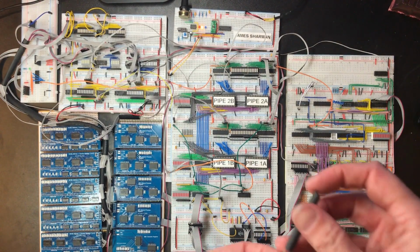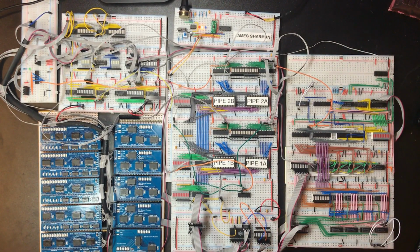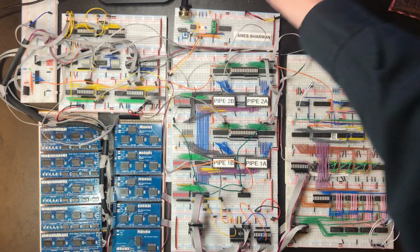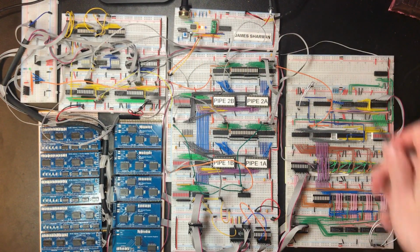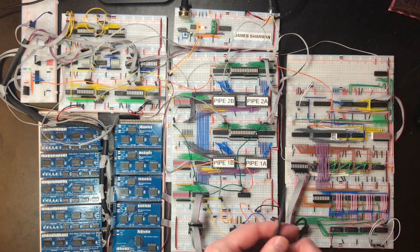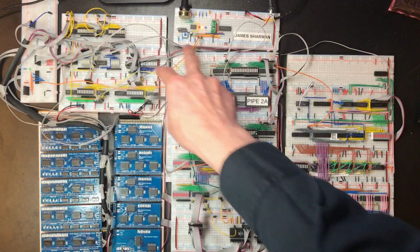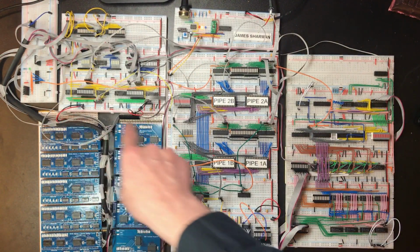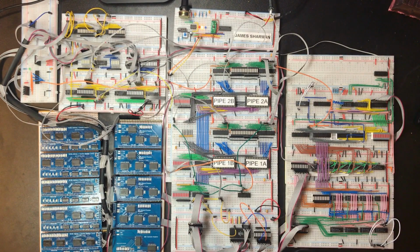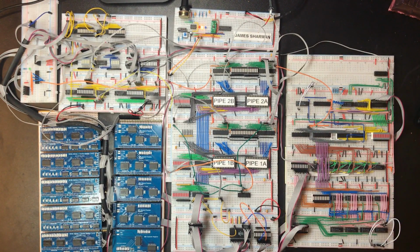It's a good start. Thread various bits of heat shrink on here. I've got some of this cable, red and black, 2 cores, and what I want to do is get a power distribution point up there and then run separate cables out, a few in each direction. I'm going to run it to every single power strip, but if I bring 3 down here, 3 down here, a couple over here, and then maybe bring separate ones out to these boards, it'll end up looking like a cat o' nine tails, but I think we'll get far lower resistance power distribution to all the locations on here.